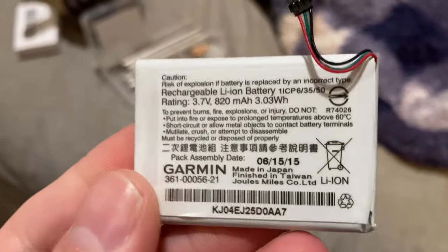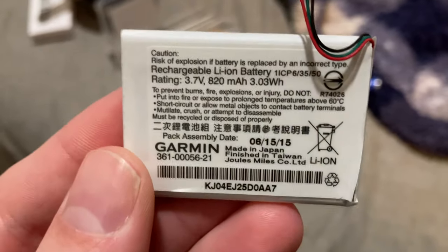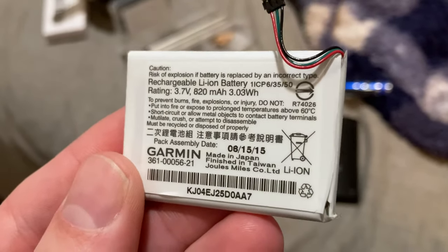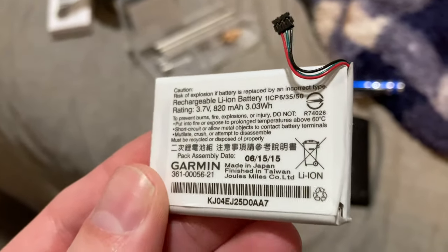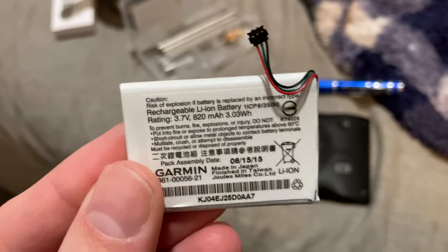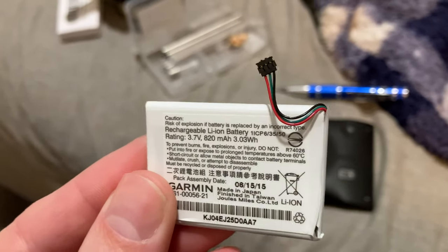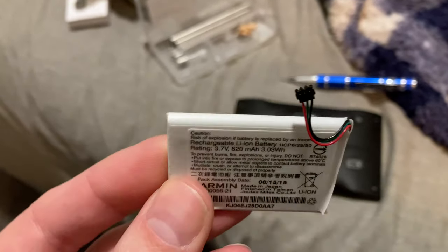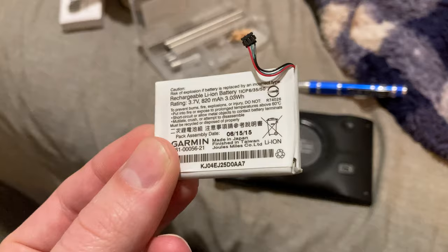Remember you've got to save these LiPos for special recycling — see that trash can logo? Take it to a Batteries Plus or a solid waste or hazardous waste facility. Save up any lithium iron disulfide batteries or any LiPo replacement batteries from drones, toys, cell phones, devices like this, or laptops. Wrap the electrical connectors with packing tape or electrical tape to prevent shorting, and bring them in for lithium battery recycling so they can reclaim the cobalt, lithium, copper, and aluminum foil.